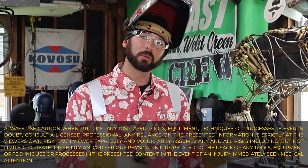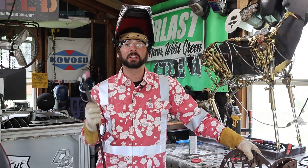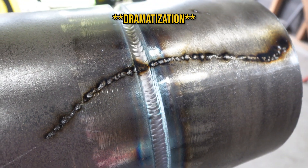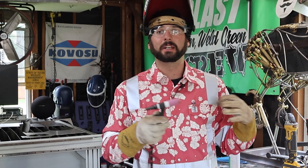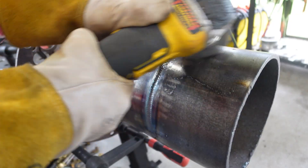What exactly is an arc strike? The electrode of the welding process — or the ground clamp, one or the other — some electrical conductivity that you're putting the material on has been accidentally grazed or touched. Whether you're TIG welding, stick welding, and the electrode from the tungsten or the stick rod happens — even with the MIG wire — if you touch the base metal outside of the weld zone or anywhere it touches, it's going to leave a little bit of a mark.